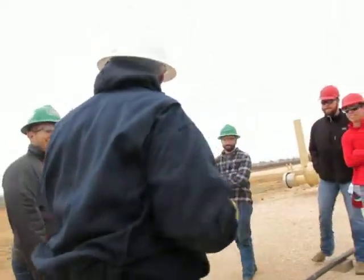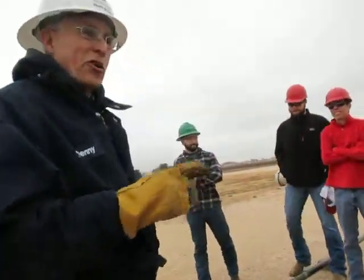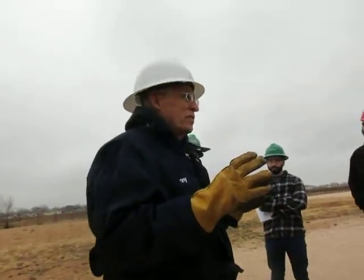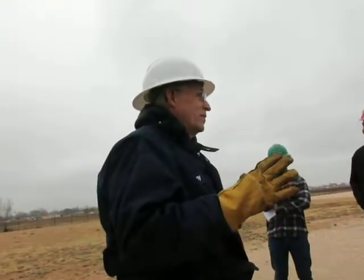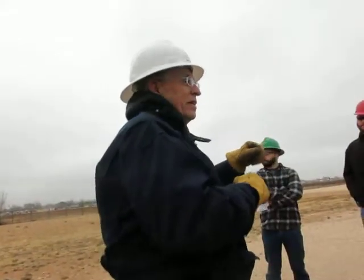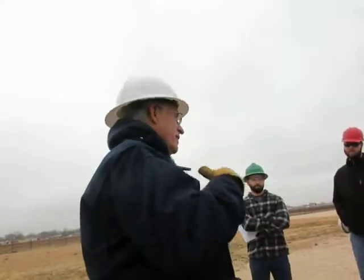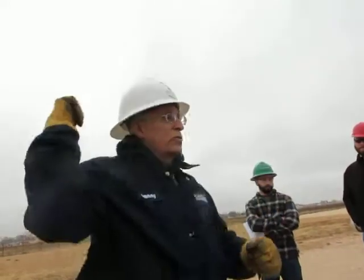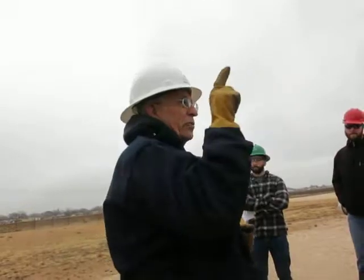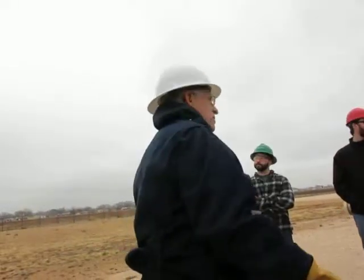Tables. That's right. You've got to look at that chart he keeps talking about, right? Is it outside the hydrate formation point? If it's inside there, we've choked it too much, we've got to do something else. But if we can open it up and we stay where we're not going to form hydrates, we can choke at the wellhead. Okay, we're going to double back out of their way and go to the header on the battery and come back and pick this up, okay?